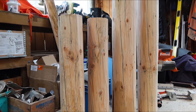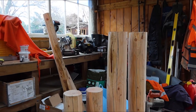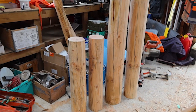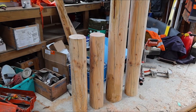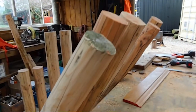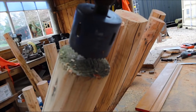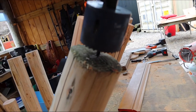There are the four legs all cut to size. What I need to do now is mark out the mortises — I've got three going in the long ones and two going in the short ones. I think I'm going to use a hole saw for the mortise tool. I've got a 60mm hole saw, which is basically the perfect size for the narrowest end of all my tenons.